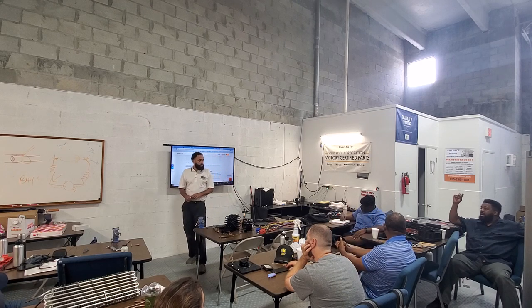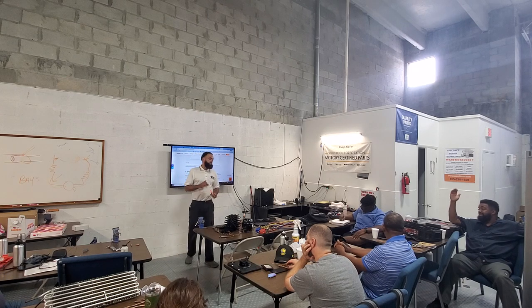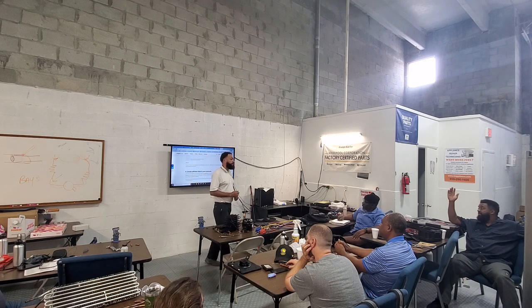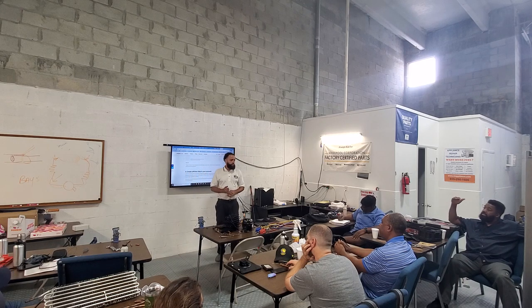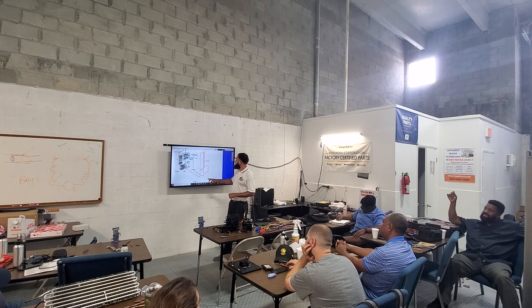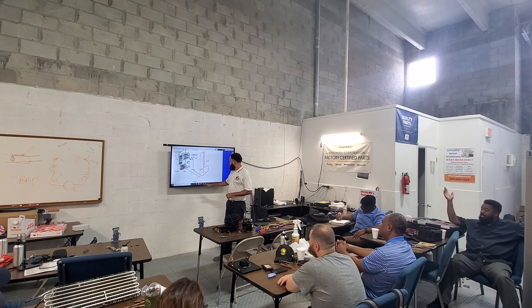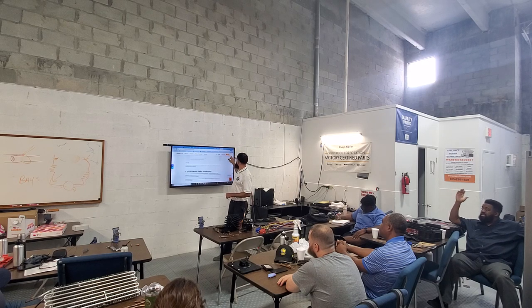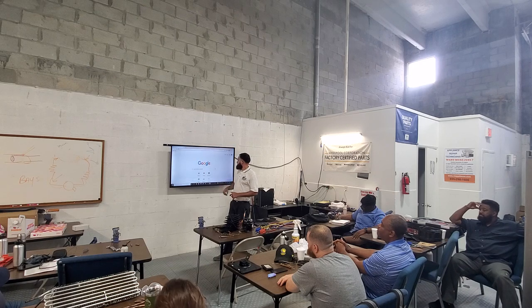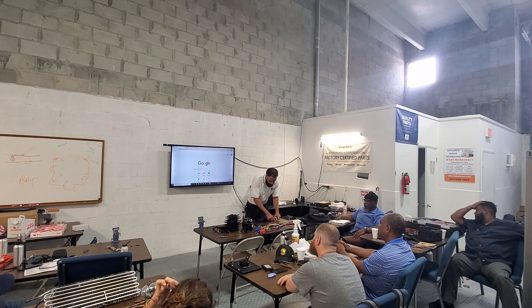Yeah, it's two different ratings. For example, the highest you could go, this is saying 400. What you never go over is 60. Okay, I'm going to see 60 PSI, and that doesn't make sense, but now I see what you're saying. The high side says don't exceed 90 PSI, right? Or the low side, either one. So you only go by whatever each side says. Unless you isolate the system, you don't go over the low side or the high side.